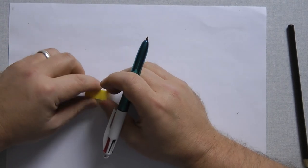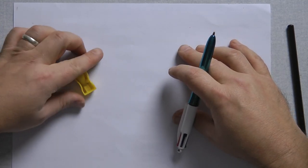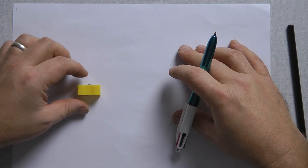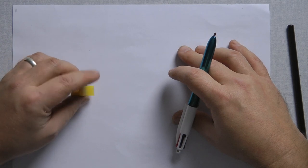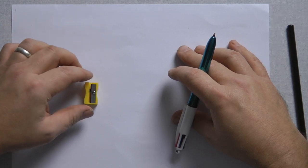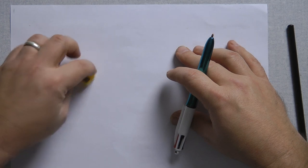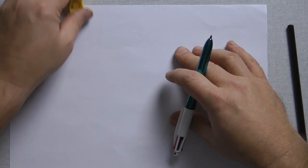I'm going to show you my view selection. I'm not going to draw the underside today — it's quite complicated. We're going to do an orthographic drawing in third angle, which means that our views rotate. As we move along, it rotates upwards — I always talk about that like a half pipe on a skate ramp — going up at 90 degrees and rotating 90 degrees this way as well.